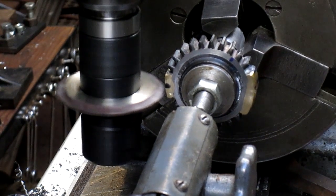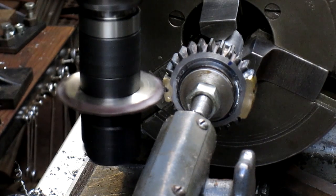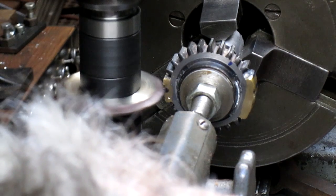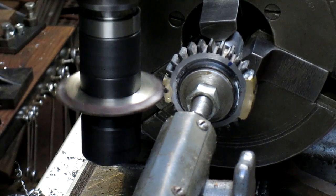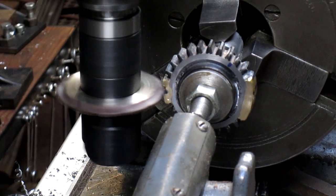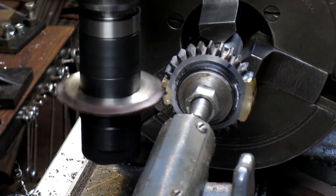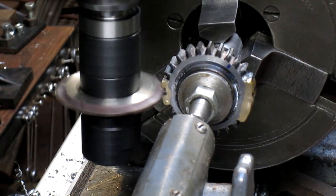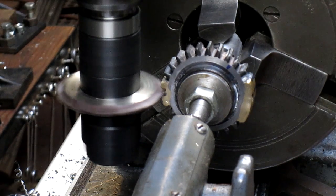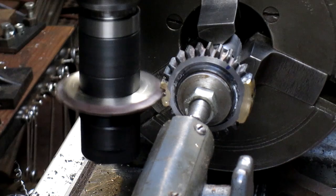And this is the brass one, the all-brass tooth. So we're going to cut this pretty slow. I'm cutting 100% slow here because we're cutting brass — I just go slow and wait, that way I don't have to come back around.